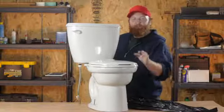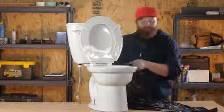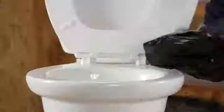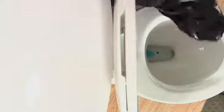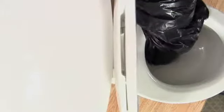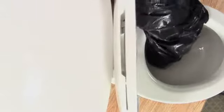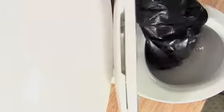So what we're going to do is open up the toilet lid here, stick our hand into the plastic bag. I'm going to kind of hold the plastic bag with my other hand so that way it doesn't fall down into the toilet. And I'm just going to reach my hand down into the very base of the toilet into the sewer line and grab a hold of that washcloth and just begin to slowly start working it out of there.